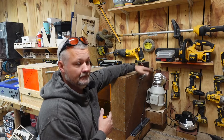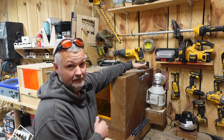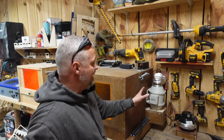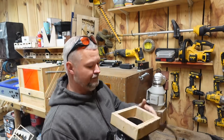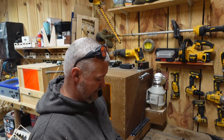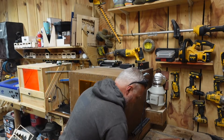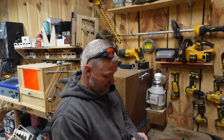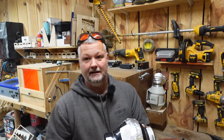We're going to try the four-inch. If it doesn't work out I may step up to a five later, but that would require redoing my duct going outside, which I really don't want to do. No matter how powerful a fan is, if it's not properly set up with proper airflow you're not going to get the benefit. So I'm going to use this little fan here to demonstrate that. You can hear it's blowing a pretty good bit of air.